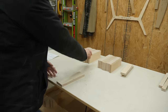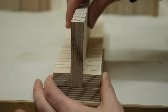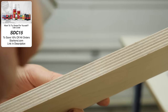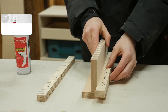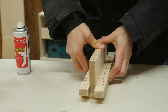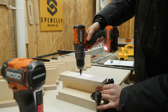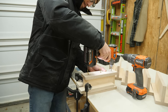With all the pieces for the T-section cut out, I need to attach those two together. To make sure they're perfectly centered, I cut some spacers to sandwich the piece dead center. Simply add some CA glue to one piece, spray some activator on the opposing piece, then press the two pieces together with the spacer blocks on both sides. After a few seconds, the glue will cure. You could add wood glue for extra strength, but I'm going to pre-drill and countersink a few holes in the bottom and fire in some screws.